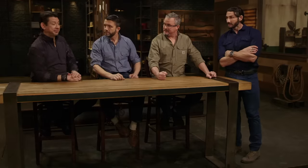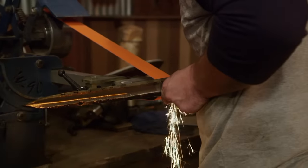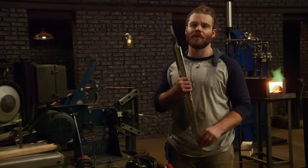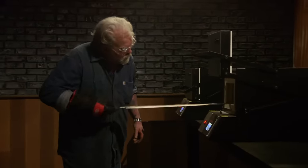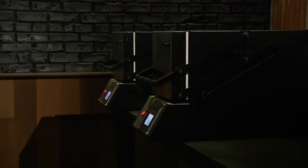That's the purpose of fullering it. Right now my blade's pretty heavy because it's still got all the meat attached and the bevels aren't ground. But the more I grind, the more weight's going to peel right off. Dave's at the tempering oven now. What tempering does is relax all that tension that's in the blade, creating a blade that should be tough, flexible, and able to hold an edge — so it should hold up in our tests beautifully.